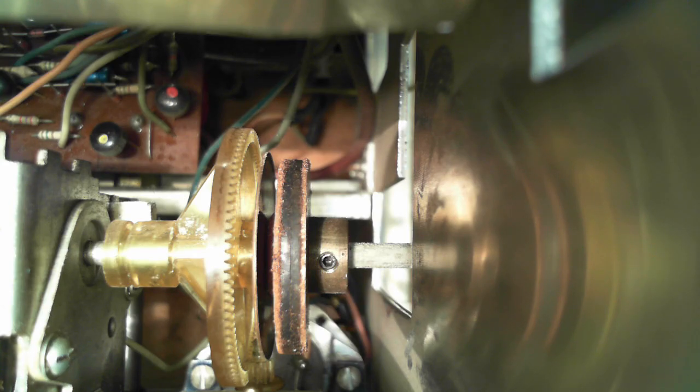So what if the idea is, when you push the button, you pull the yellow gear back slightly, and that causes the rubber clutch to separate. The whole thing goes. We can call it the yellow gear. In between is a tricky way to spring load the yellow gear against the knob gear, and then you just need the slightest separation in the clutch mechanism, the actual rubber clutch mechanism, to make this whole thing work.